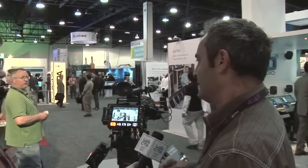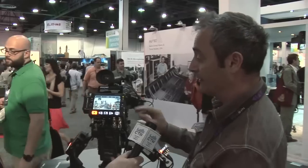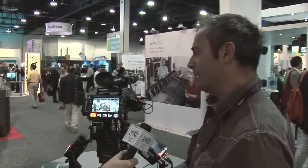We have very high-quality video and very high-quality audio. There are a couple of high-quality mic preamps on the bottom, using the same quality mic pres as our 7-series high-end audio recorders. They can also be configured for four channels of AES digital, and we can have up to eight channels of audio by taking eight channels via SDI. Another important feature is the built-in timecode reader and generator, and it can also act as a Genlock master.